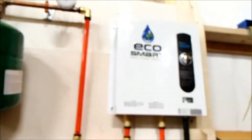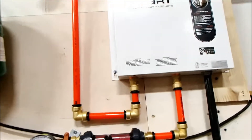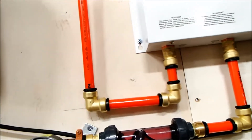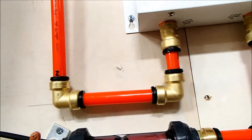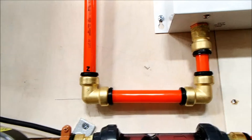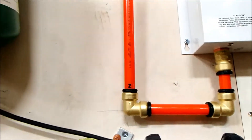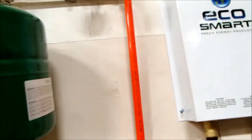The hot water heater uses 3/4-inch fittings in and out. I'm using 3/4-inch PEX with Watts quick-fit fittings, which makes for a really nice install. They work with PEX, copper, and PVC — no sweating required. You just push them on and you're able to rotate them slightly, which makes doing the install and building the panel a lot easier.